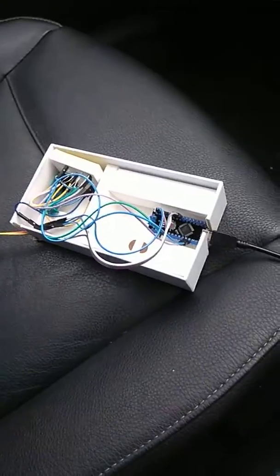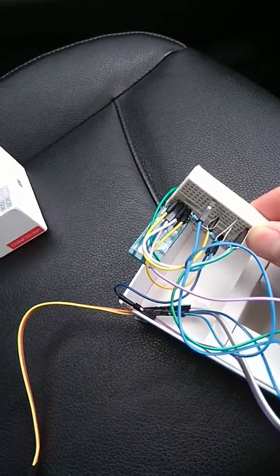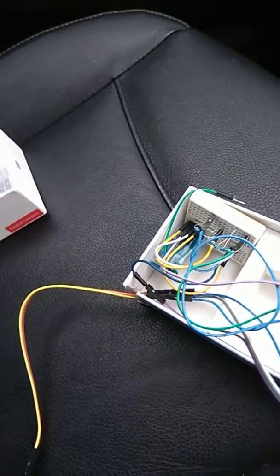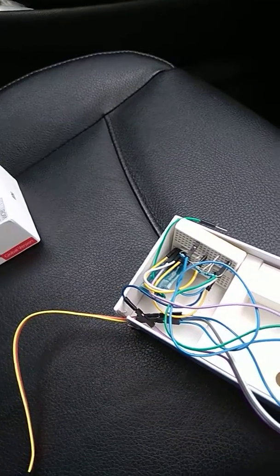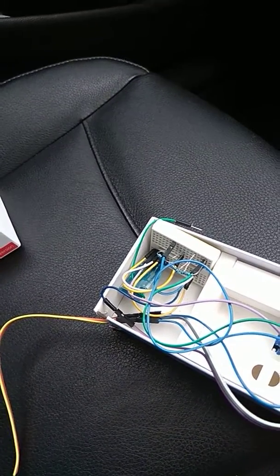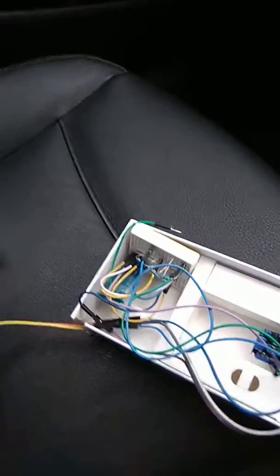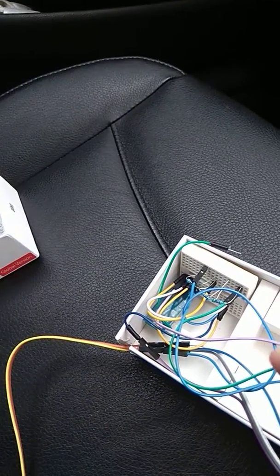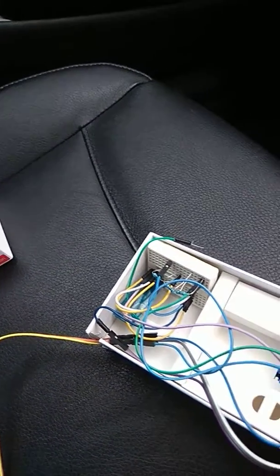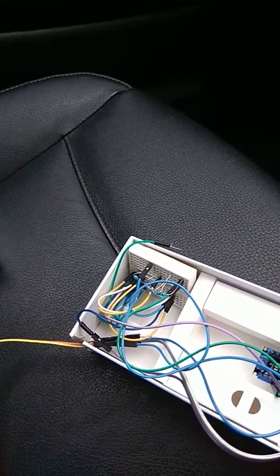What I have here is an Arduino hooked up to a Bluetooth module. I've done a software serial to communicate with the Bluetooth chip. The transmission from the Arduino is done via a voltage division — these resistors over here — because the Bluetooth board actually operates on 3.3 volts, not 5 volts. So you want to do a voltage divide to drop that down.